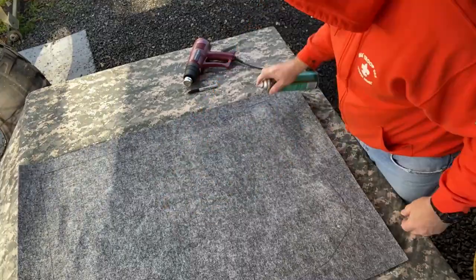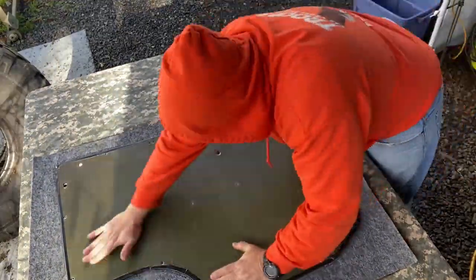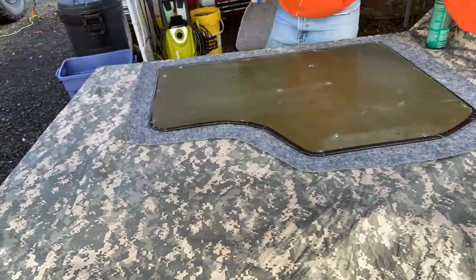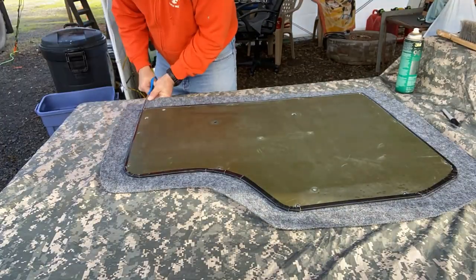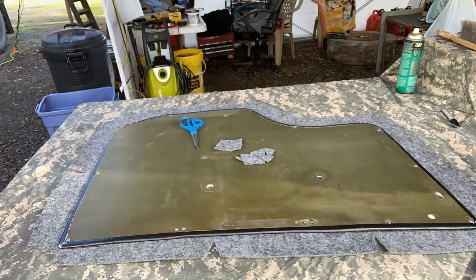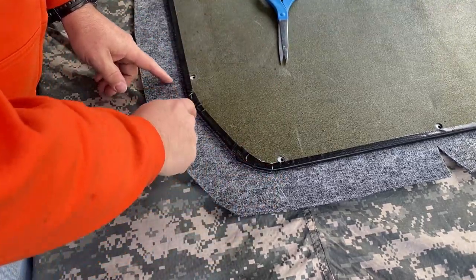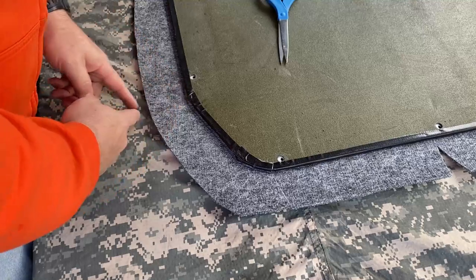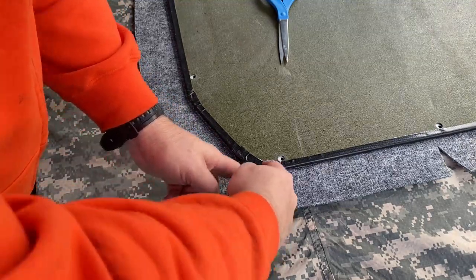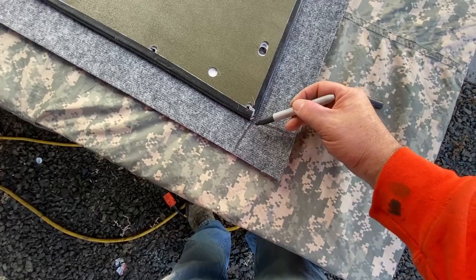So that's the rest of the story. Now, I know I breezed over this pretty quickly in the last video — but everywhere where you have a bend, even these small little bends here, you're going to have to take out nibbles. This is a really quick bend here so you probably just need one, but here you're going to have to take out probably two to three. Don't make any cuts within a quarter inch of the edge because it still needs to wrap around this corner.